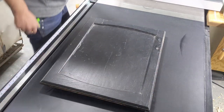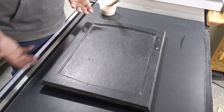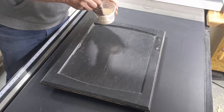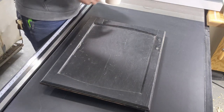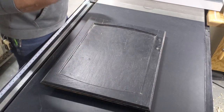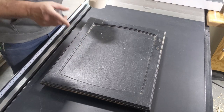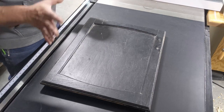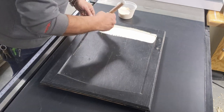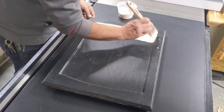Okay, what we're gonna do is painting — we've got to get this door painted, but we've never painted anything before, but we still want to make it look presentable. So tips and tricks. I actually painted for a while. If I'm gonna attack this door, I'm gonna start with this panel and then come around like this. The guy that taught me how to paint told me to always maintain a wet edge, and what he meant by that will be clear as I start to paint. I can just kind of jab the paintbrush down and pull it back from the corners.